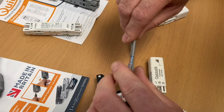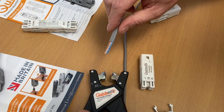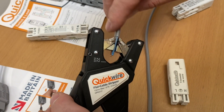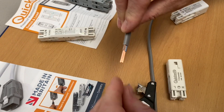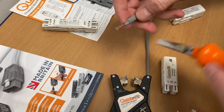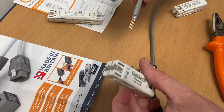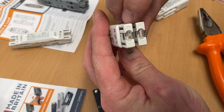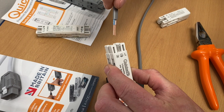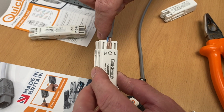Simply pull and we take that away. Now you've got to remove between 15 and 17mm of the insulation around the conductors. Bring it in so we've got the PVC - the grey part level with the top of the strippers - and we've removed the outside PVC and insulation. Because it's a short length they're slightly different in length, so I'm just going to trim those back. Bringing in our T connector - got to make sure you get it the right way. There are three little holes in there and that's where our connections are going to be made.